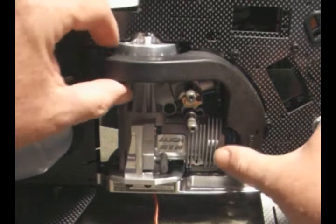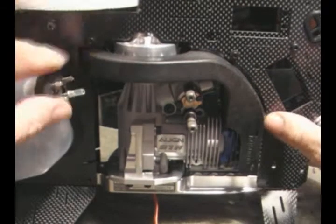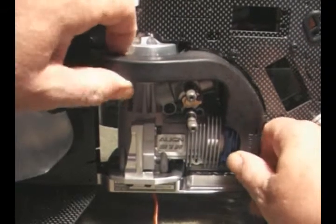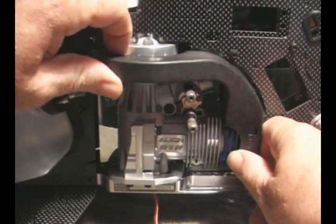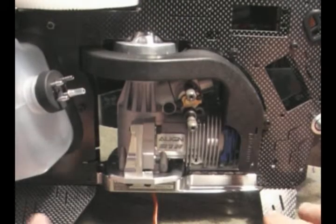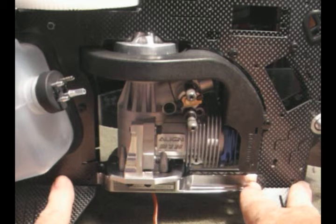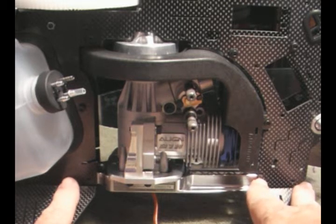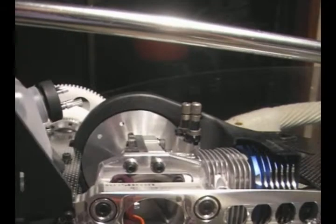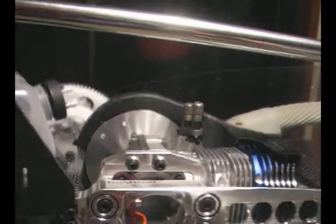It's not worth doing up these fan shroud bolts, the three of them, until you've got the frame secured, because you've got a little bit of adjustment there just to make sure that there's no chafing of the fan on the shroud at all. So we'll do up our four mainframe attachment bolts at the bottom there. Then we'll check for position, and very little clearance down there. You can see that fan. Not very good lights there, but there's not much.